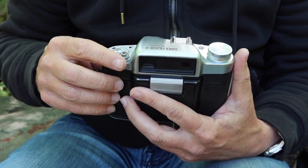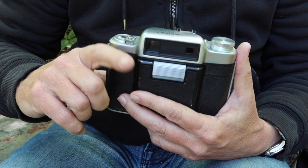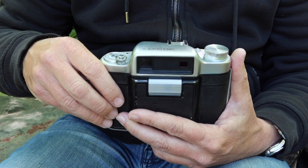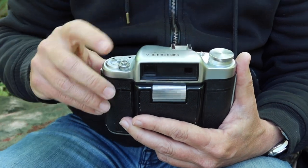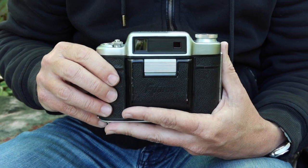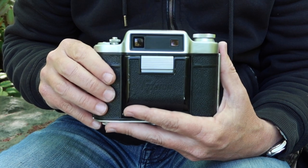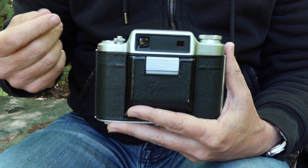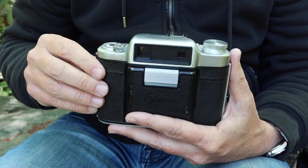The Pearl 4 had a cable release feature but it was separate from the shutter button. On the Pearls the shutter button tended to be on the front cover, and many other cameras needed a sophisticated adapter. Having a cable release on cameras like this is really important because they are well suited to long exposures — landscapes, shooting at smaller apertures on a tripod — so it's a really useful and necessary feature.